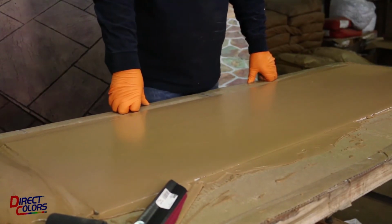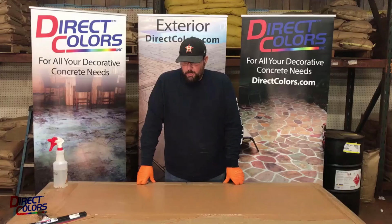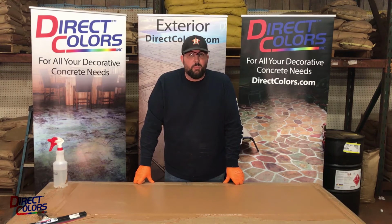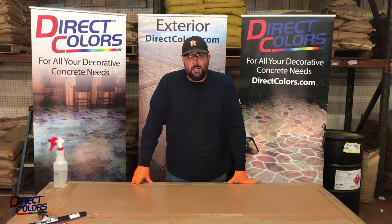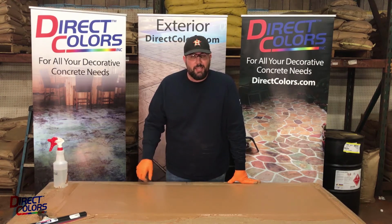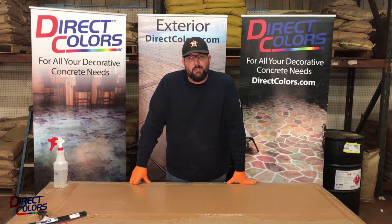So this is a pretty nice finish right here. We've got the integral color. As I mentioned in the lead-in, there's about 116 colors you could color your overlay with. It's pretty extensive. It's also a product that you can acid stain. I've got 10 different colors of acid stain that you could come back, and it's actually hyper-reactive to acid stain. It's got a lot of Portland cement in it. So that's pretty much the process. We're going to come back in a little while and show you a little bit about sanding. So if you get these little ridge lines, I've left some ridge lines in here on purpose. I'll show you how easy those are to sand out if you get on them at the appropriate time.